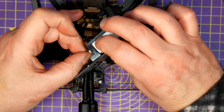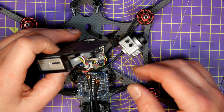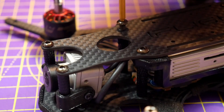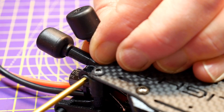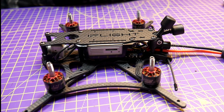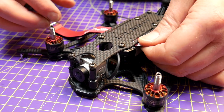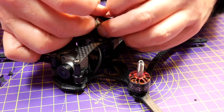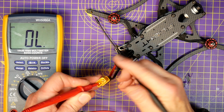Push the DJI interconnect cable in place — it's keyed so it will only go in one way. Connect the antennas, push the camera onto the front standoffs and adjust the up-tilt, then bolt the top plate back into place. Adjust the antennas and tighten up the bracket. Finally, check the fit of the battery strap under the top plate and check there's no short circuit across the battery terminals.